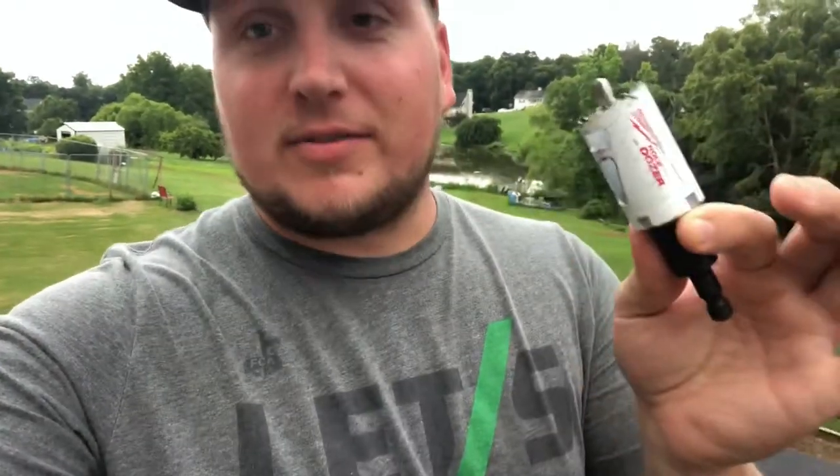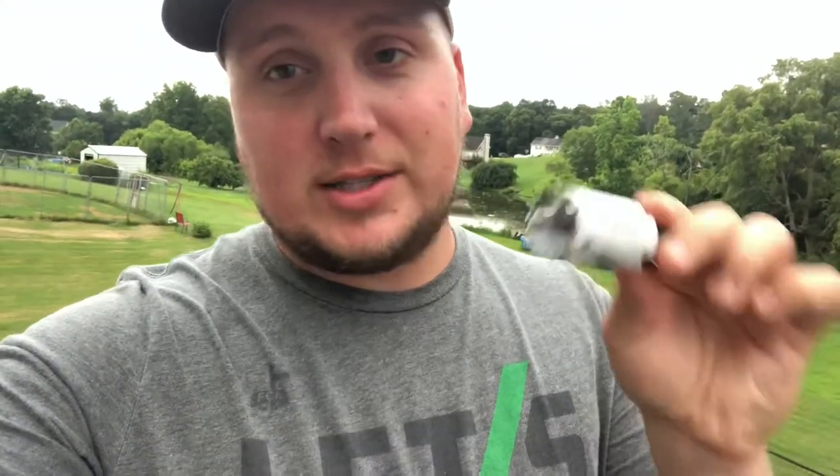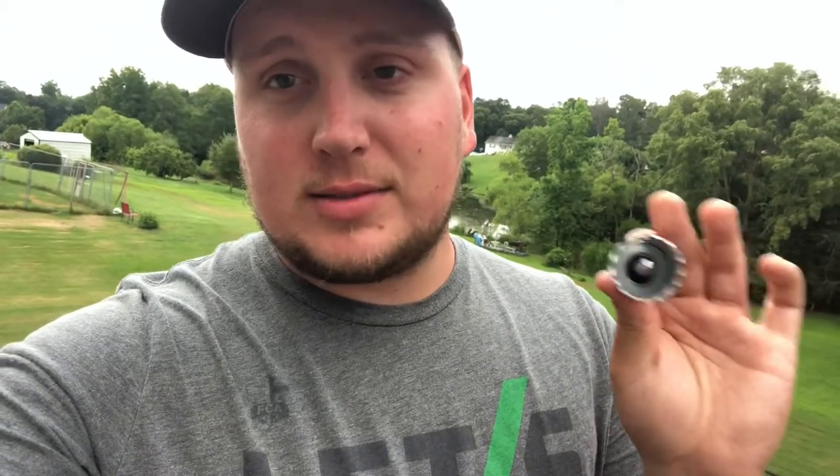This is the most expensive part of the whole project — this little tool right here. If you don't have one at home, it was about $15 by itself, which is more than the cost of two of those grommets, so maybe you can borrow one. What you need is a one-and-a-quarter inch hole saw. Attach it, and you can pre-drill if you want to — we're not going to today — but if you're worried about hitting a very specific spot, go ahead. Just work your way through, and once that hole goes through, pop the grommet in.